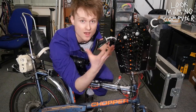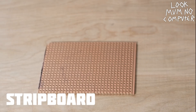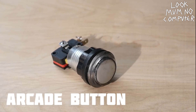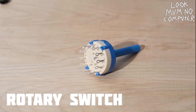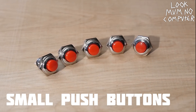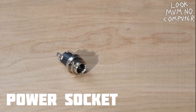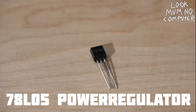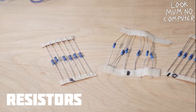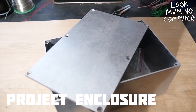So let's take this design and put it into its own box. Here's what we're going to need: one Arduino Nano programmable chip and a socket, some stripboard to solder all the pieces to, a big light-up arcade button, two potentiometer twisty things, one rotary switch, five push buttons, seven mini jack sockets, one power socket, six LEDs and holders, a couple of mounting rods, a 7805 power regulator, a bunch of resistors, loads of pretty coloured wires, and of course, the box.